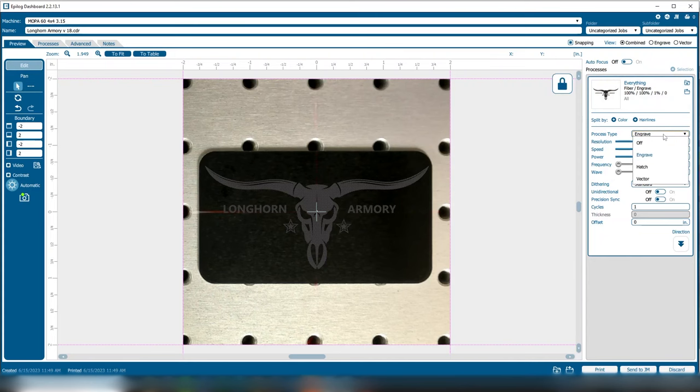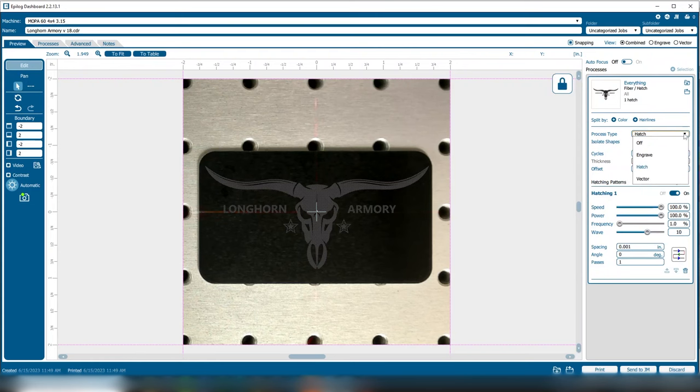Here we have some different processes: engrave, hatch, or vector. The hatch is what most customers are going to use on the G100 machine. This gives us the ability to set a variety of different hatch angles for deep engraving — it's a wonderful tool for better, more consistent deep engraving. The engrave function is new to the Epilog G100 machine — this is what you'll use for processing bitmaps or photographs. It emulates a flatbed laser where the galvo is moving left and right and approaching the front of the machine. So the engrave function is for bitmaps and photographs, but generally you're going to be working in the hatch function.